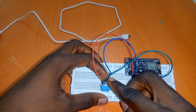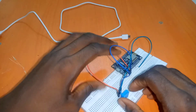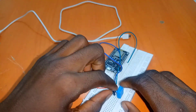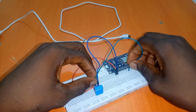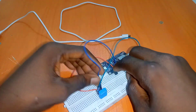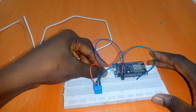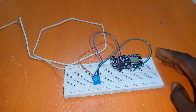Connect the fourth pin to ground. So once again: connect pin one to 3 volts of the NodeMCU, connect the 10K resistor between pin one and pin two, from pin two connect to D4, leave pin three unconnected, and connect pin four to the ground of the NodeMCU. Now I'll plug it in and we are going to do the necessary setup on the laptop.